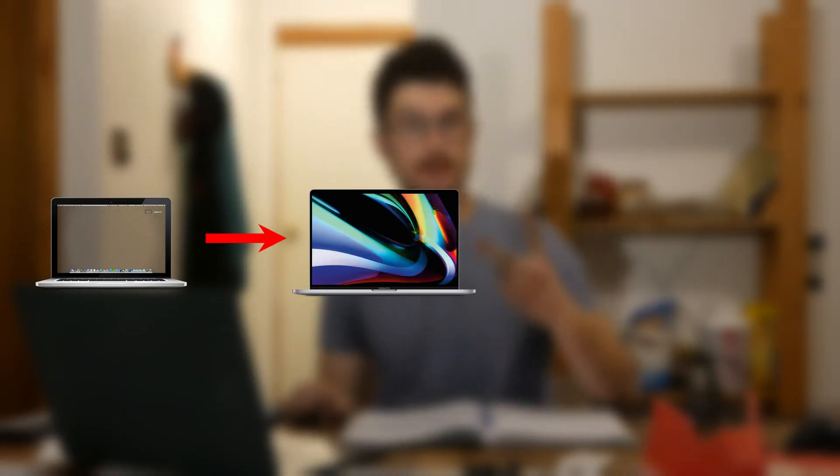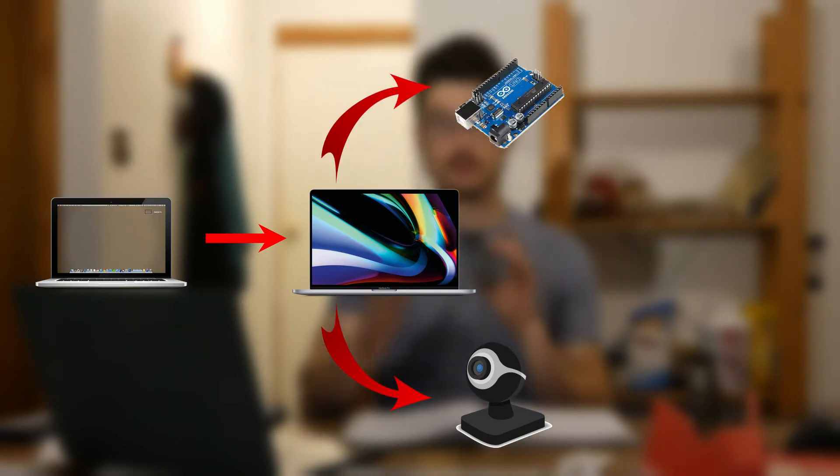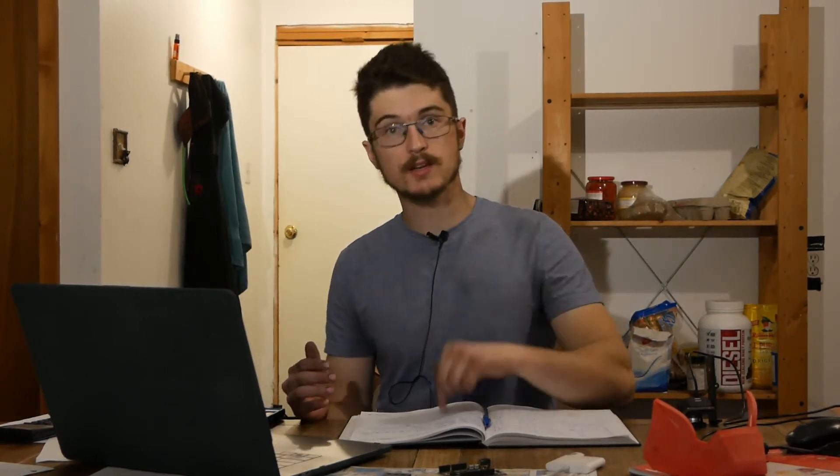So this is how the chain of command works: I have one computer or my phone anywhere in the world talking to a second computer here in this room. This second computer is connected to two things: the camera trained on both the 3D print and the screen, and the microcontroller. From the microcontroller we connect to both of the servos. Using two computers is a little overkill — a little like using a nuke to kill a fly — but it's all I've got. Hopefully in the future I can replace this second computer with a little special chip that connects to the Wi-Fi.